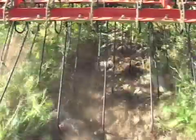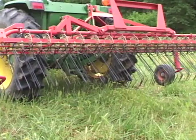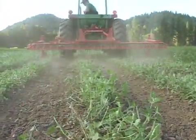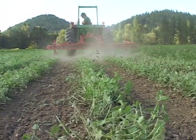It works better at high speeds. It works well in rocks — it won't get all the weeds around a rock if the rock is big; it'll just bounce right up over the top of the rock. These tine weeders come in a variety of widths, anywhere from 3 or 4 feet wide to 30 feet wide depending on your application. This particular one is 10 feet wide and it covers all four of our rows because we're set up on a four row system.